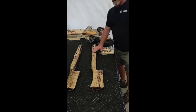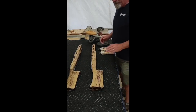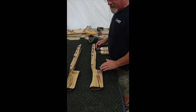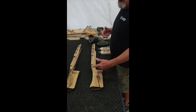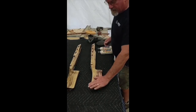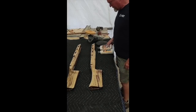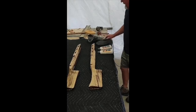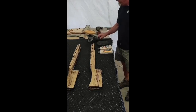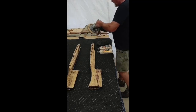Okay, welcome back. We've sanded these stocks with 2000 grit sandpaper. When sanding this stuff it's obviously wet because you're using wet-or-dry sandpaper. You wipe them dry with a paper towel, and if you hold them up to the light, you can see the spots you've missed because it's going to be dull versus shiny. Now they look smooth and great — beautiful stocks. Now we're going to do what's called buffing them. I usually start with a medium cut. We have a buffer and two pads: a cutting pad and a polishing pad — they're a different compound of foam. I usually get my pads wet and soft first so the pad doesn't suck up all the compound.